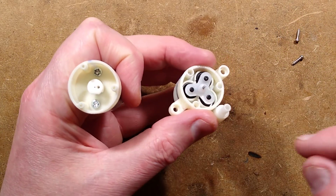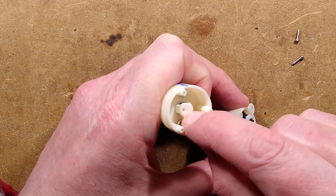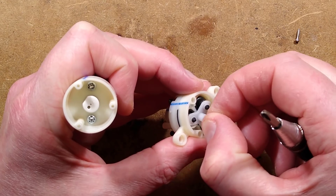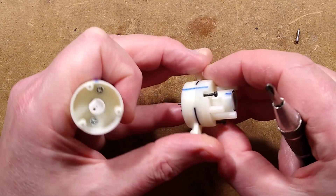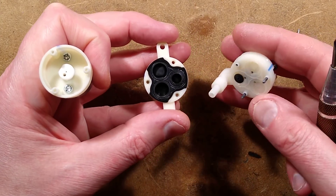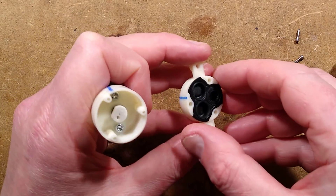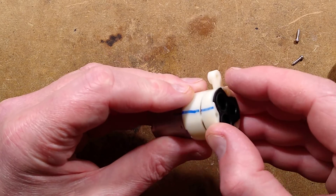Same arrangement as many of the others — it's a swash plate pump. The motor itself has an offset eccentric cam with a hole in it that goes onto a pin, and when it runs it pumps these little cylinders in a pattern one at a time — a very simple way of doing things. The liquid intake is coming down into the smaller diaphragm pump, exactly like the other one, and the two larger pumps are for air.